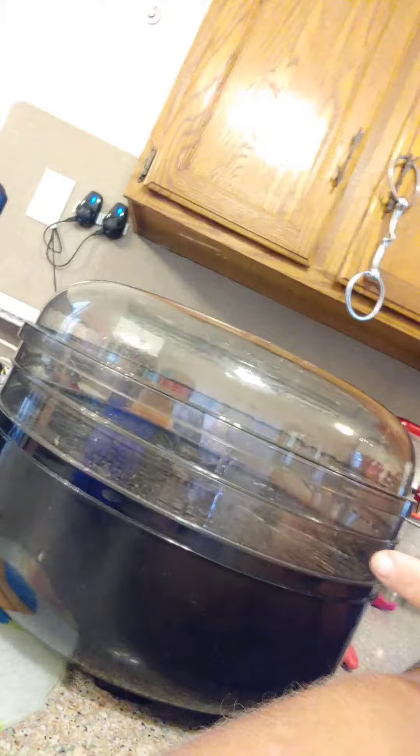The reason why is because the filament was wet. I know it was wet because it was making that characteristic popping noise when the filament goes to extrude. I unfortunately haven't bought a filament dryer yet, but I was at an estate sale the other day and picked up this toaster oven, and they threw in this food dehydrator.